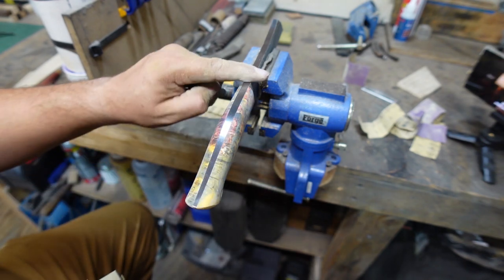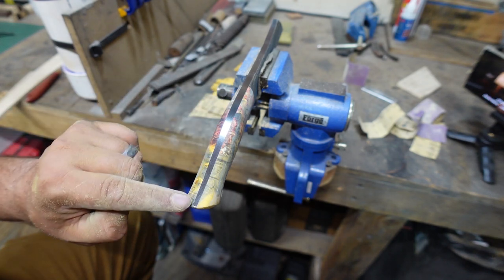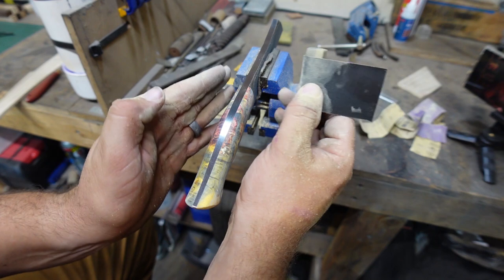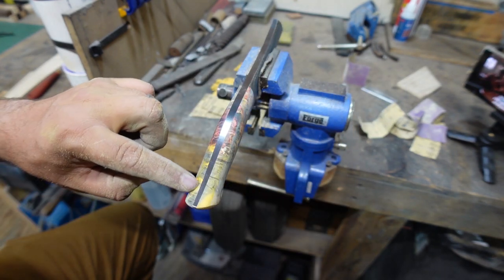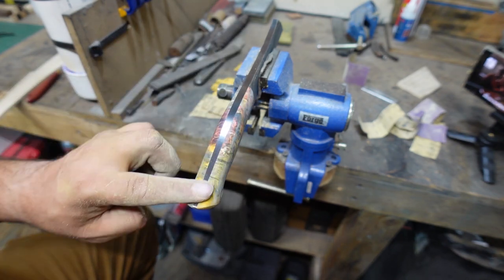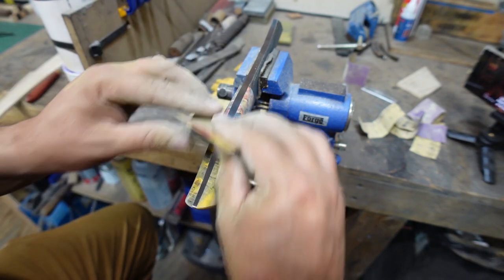But the nice thing about this is it's super tight, so there are no gaps in our beveling that we did to make sure everything fit, and our flattening of the tang made it to where there is an actual perfect marrying of the wood to the steel with zero gaps. Gotta love that.